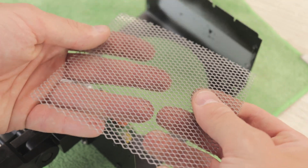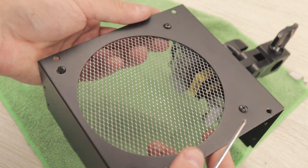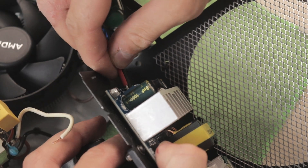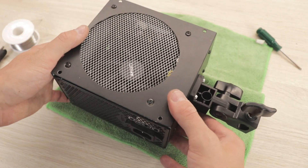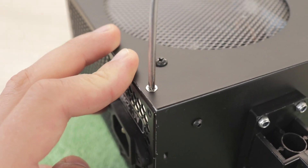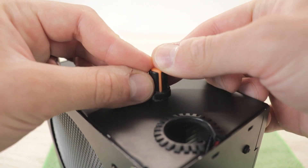I use a few pieces of double-sided tape to attach the fan speed controller to the case. The potentiometer can now be mounted making this a convenient brightness knob. I now use a piece of steel mesh as a protective grill. Finally the power supply unit can be connected to the boost module and the AC input accordingly, making sure all connections are secure. The case can now be put back together with the four screws holding it. I add this plastic knob and the light is now completed.